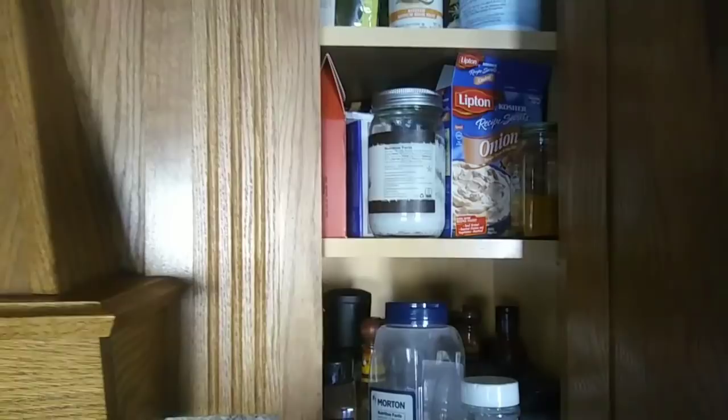When the doors are all outside, you're going to have to tape off everything inside so you can paint the frame edges. When we do it, we put up zip walls and plastic draping all the way around the entire room — every door and opening — and cover the entire floor, so dust doesn't build up. When we walk away, it looks like a fresh, clean new kitchen.